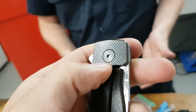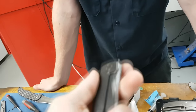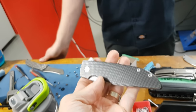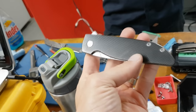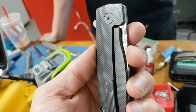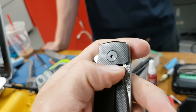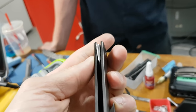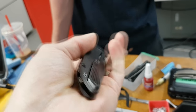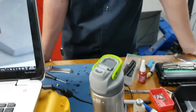You can see the pivot — this is one of the things we're really upset about with DLC. This pivot and many other parts just didn't get a good coating. This set of handles — when I was getting ready to send stuff to DLC, I thought the more parts the better so we can see. This was a completely unfinished set of handles. Usually Eric puts a lot of love into the edges and tumbles it beforehand, but I just wanted to see what it would look like. It looks amazing, but little stuff like this is completely unacceptable. Some of the spines weren't really coated enough — still kind of silver. We just need to work with them more and teach them what we need and exactly how it needs to be. It's got to be something in the cleaning process. When they tried to redo the parts, it actually got even worse.